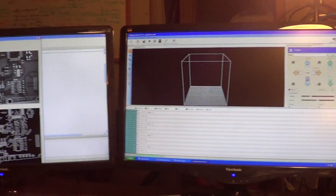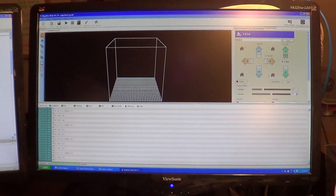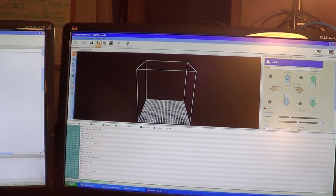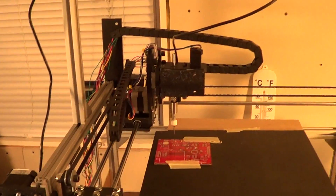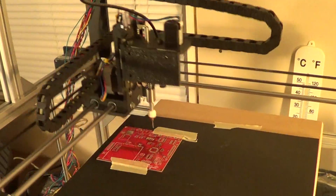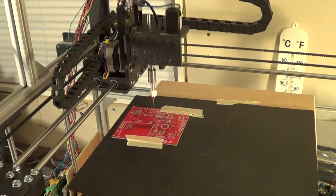I'm using Repetier also to run some G-code to drive my machine to its limits to test if there's any slippage. I've already loaded the G-code and I'll run a test pattern now. Here's the machine — it's homing — and it appears to be pretty accurate. I've got a board and the needle pretty much always hits the same hole every time. So far, looking pretty good.